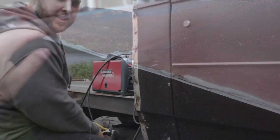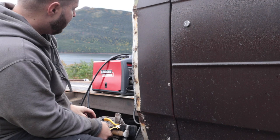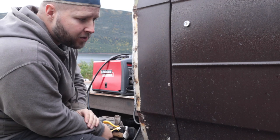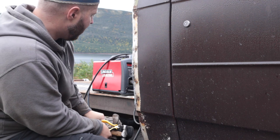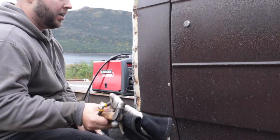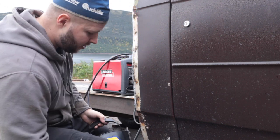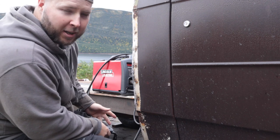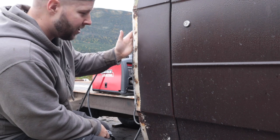Nice. It's a Lincoln Electric 140 multi-process, and I'm running it at the third lowest temperature setting, or amperage setting, and running at number three, so the third lowest on wire feed. Now I haven't looked at the gauge to see if that's proper according to their specs, but I don't need to. That's what works for this scenario here.